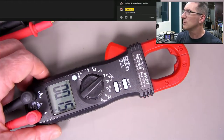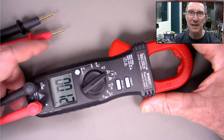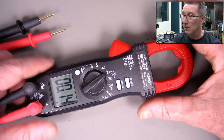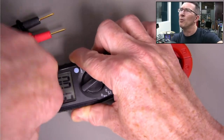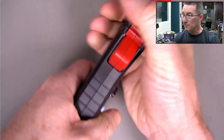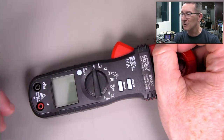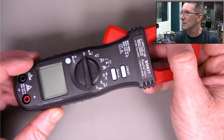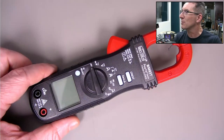I don't think any of them really go down to a milliamp - I'd be surprised if you can find one. It's a totally different technology. You can get leakage detector ones specifically designed for low current leakage detection, but I don't know of one that has both. The clamp design in general isn't able to accurately measure below 10 milliamps. It's just a limit of the design.